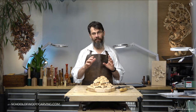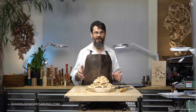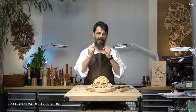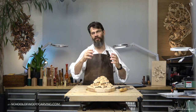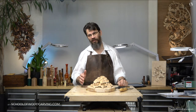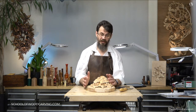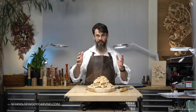And for example, if you do have a chance to dry that, place it somewhere like I do. I keep my lumber. I have a sauna, and right on top of the sauna I have a whole stack of material, and I keep it for years. Some of the pieces, those fibers, you know, seasonal expansion, it's puffing, going back, puffing, going back. It all depends, of course, on the weather outside, winter, summer. It's not as much in Florida, by the way, because it's always humid. Summer, winter, it's always hot and humid, so it doesn't really move as much. That's what I noticed. Maybe I'm wrong. But still, if you have seasons, wood will adapt to the environment, and it's going to move, okay?